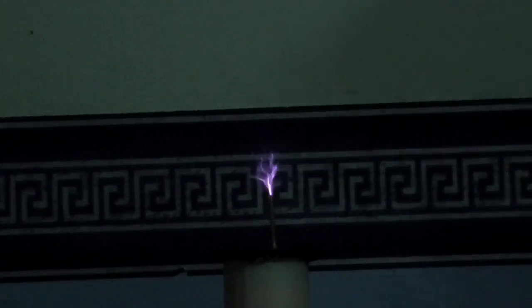We have a PLL Tesla coil. And it's working really good. I'll just do a run at 46 volts AC. I like this. I like this a lot. This is about 93 volts in, which is going to be about 130 volts DC. This is without the main filter capacitor connected. That looks pretty good.